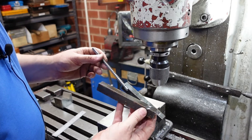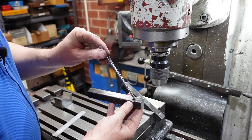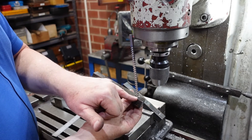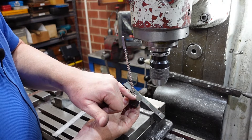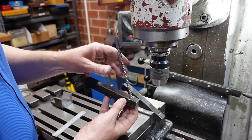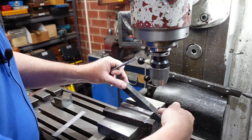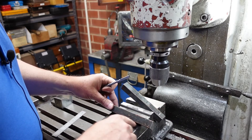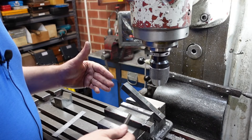What I don't want to do is disturb the hole, because what's going to happen is the broach will go in there. If I've got a flat surface, there's going to be equal pressure on the broach all around — that's quite good. However, if I've got part of this missing, I'm not going to have the cutting forces balanced on this side, so the broach is going to be slightly unbalanced. I'm trying to avoid that by putting these flats on here. I've got two types of flat — a straight cut across and one fed with an end mill — just to see how those work. So I'll take a little off the top and bottom, much more off this one, then broach the holes and square everything else up.